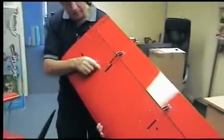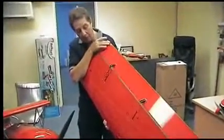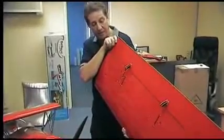As I'm running the BLS 152 31 kilo servos, I only require 1. It's not an enormous surface, and I'm running 1.25 arms, which gives me a reasonable amount of deflection. It makes it roll quite fast actually.